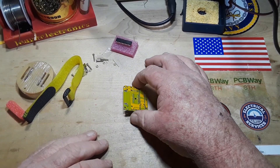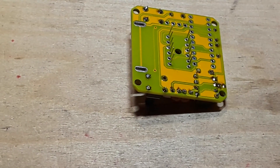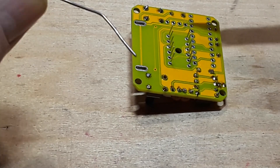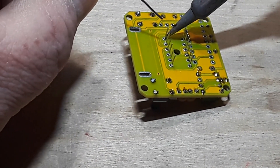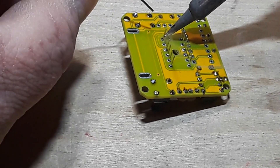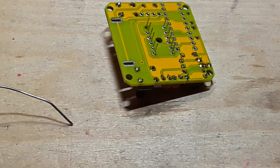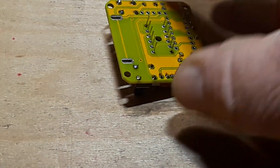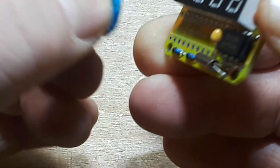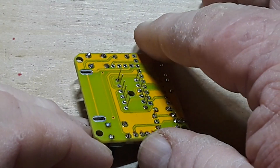Alright, let's zoom in here and get to soldering our last two parts. There's one pin in — I just want to make sure everything is sitting flat, and it is. So I'll come back and solder in the other pin. Now I can remove the Blu-Tac and it's steady, not going anywhere, so I can just come in and solder it.